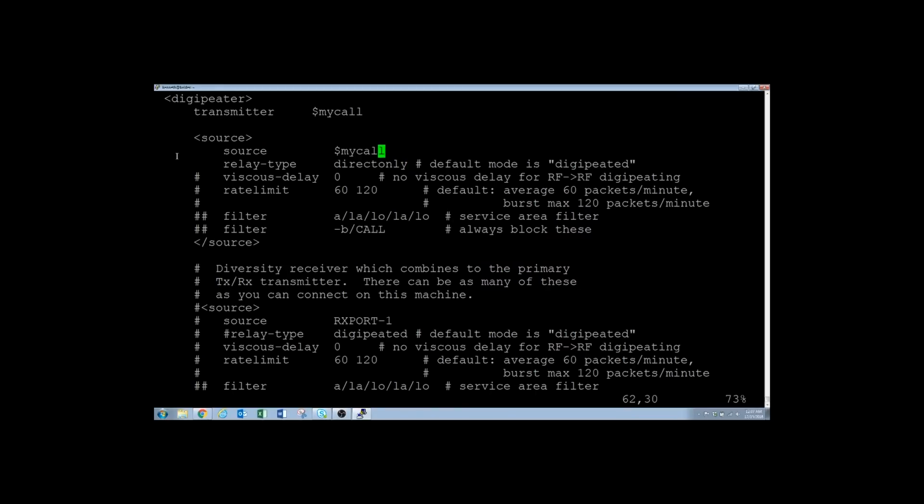This is not how APRS digipeaters typically handle this fill-in role. Typically, that's just by strictly following, only digipeating on the WIDE1-1 alias. But that WIDE1-1 alias thing was really a hack for legacy firmwares, and we're not limited by that, right? Because APRX was developed post this idea. And so this fill-in digipeater concept is baked in.